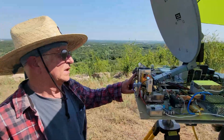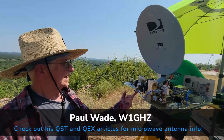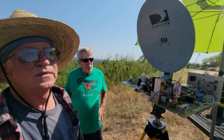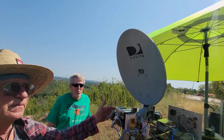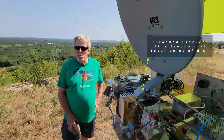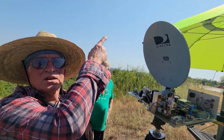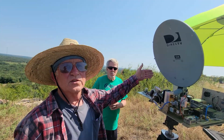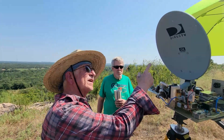This feed horn is a W1GHZ dual-band feed horn. The back end is 24 GHz in waveguide, and the coax connector on the side goes to 10 GHz. It's basically built on a little bracket to put it in the focal plane of the dish. To test this we use converters and convert down to 28 megahertz and look at the sun — you point it at the sun, then point it at the cold sky. This is seeing about 3 to 4 dB of sun noise, which is excellent for a small dish like that. The dish at 24 GHz has about 40 dB of gain.